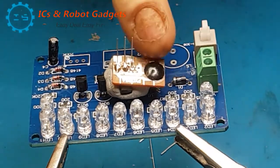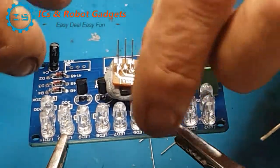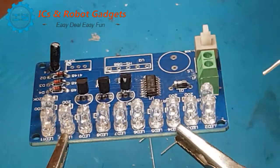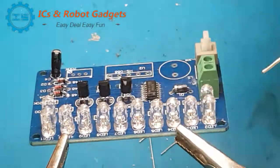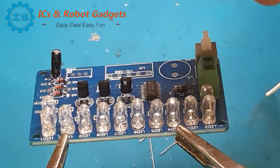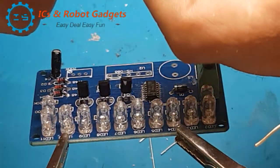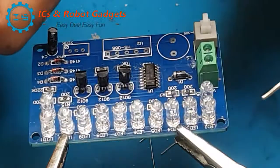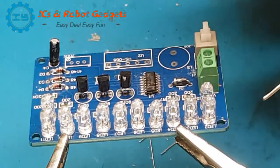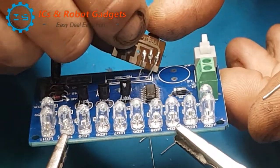When it's on the board, I think we'll have to connect this last terminal here, which is basically the positive, onto this terminal. That bit all the way. So yeah, there we go, transistor's flat side up against the board, the legs are poked through. Now these two I think go into the board, because the first two holes in that picture it's showing, I think with this leg up, but we'll snip that. So we'll poke those two in there like so.